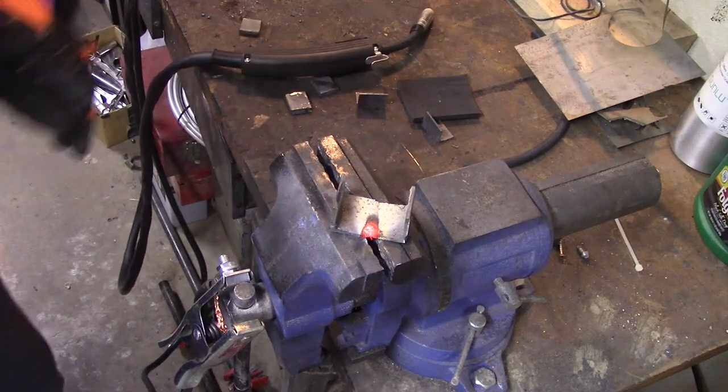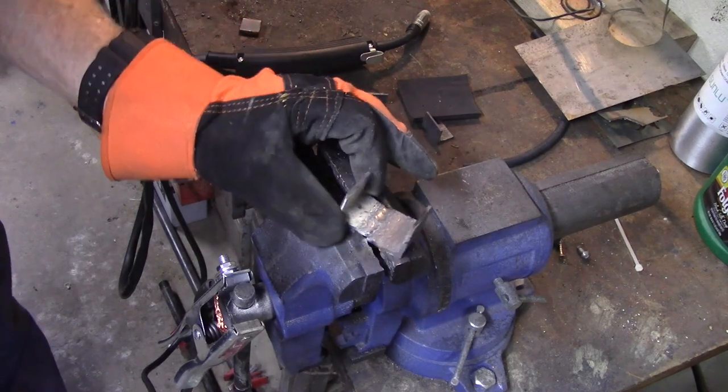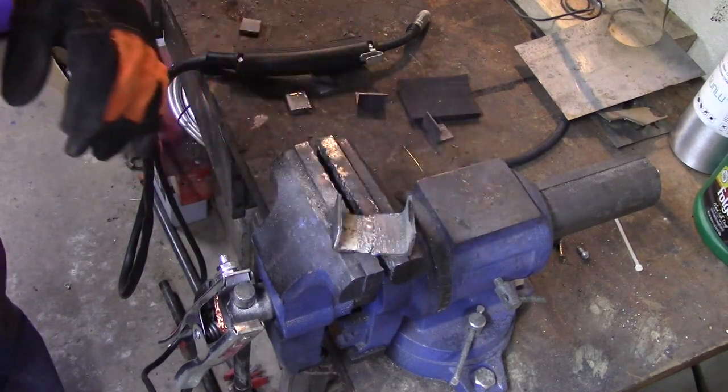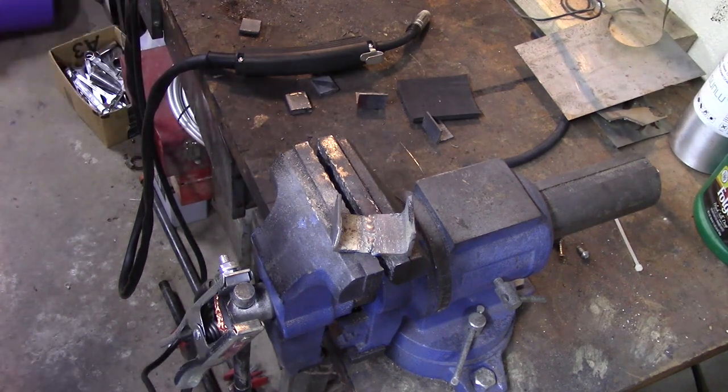A little cold starting out. It ended nice, but a little cold starting out. So just as I thought, I'm going to turn my machine up. I'm going to go up to 80. Actually, it says 79. And I'm going to run the voltage to match.